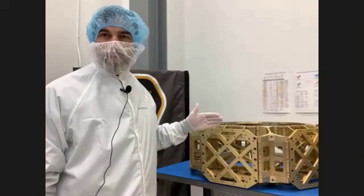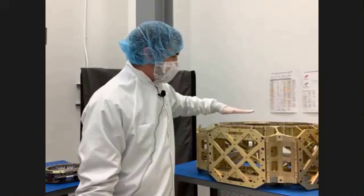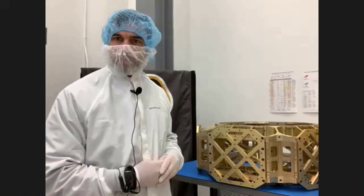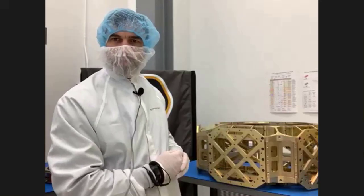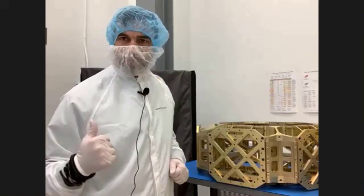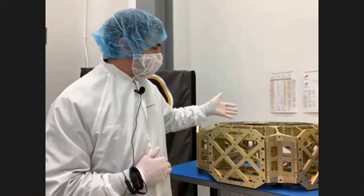On the rideshare mission we're doing in two months, we're flying three of the 8-inch motorized light bands for our microsatellite customer Hawkeye, and three of the QuadPak type dispensers. On the forward face here, this is our forward port, and it gives us a lot of flexibility. While we generally reserve this port for our largest customer, we can accommodate microsatellites to about 100 kilograms. There's another 24-inch interface here, which we often net down to a 15-inch or an 11-inch depending on what is compatible with the spacecraft. We can put an adapter to mount more CubeSat dispensers, a mount with solar panels to power our electrical propulsion element, or we can even stack Sherpas up if we need to.